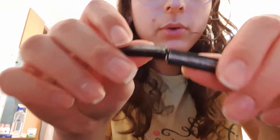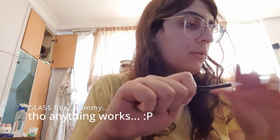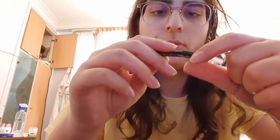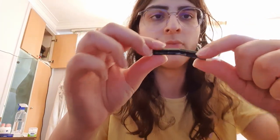So, it broke here, like the actual glass fibers broke. That took a lot of strength, okay? That would have probably broke the XY sample. So, sorry, this is the Z sample. So, what do we learn from this? The carbon fiber reinforcement so far, we've managed to immensely increase the Z strength of this part, but also add a lot of rigidity to it with just 3 fibers. I mean, again, I could just lay 4 on this very thin part and we could get more.